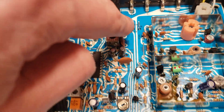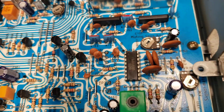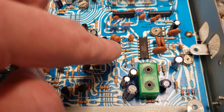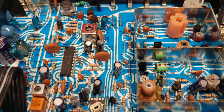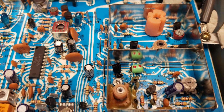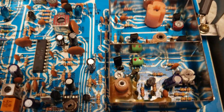Starting with the oscilloscope, I started probing these various test points here and here. There was a strong audio signal and carrier signal present here when the thing was working, but not when it wasn't working. Based on some other measurements I took up here closer to the variable capacitor rig, I discovered it was probably something inside the variable capacitor.